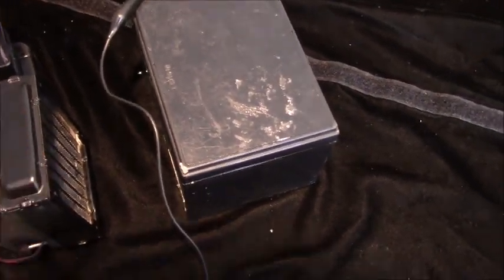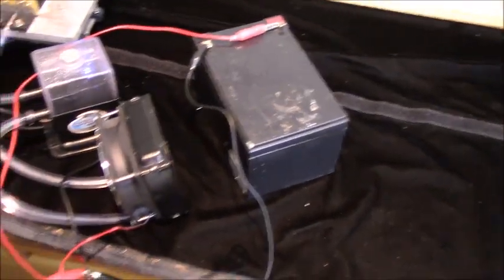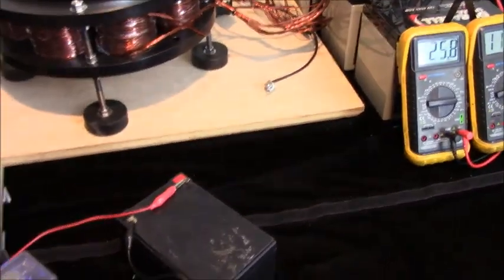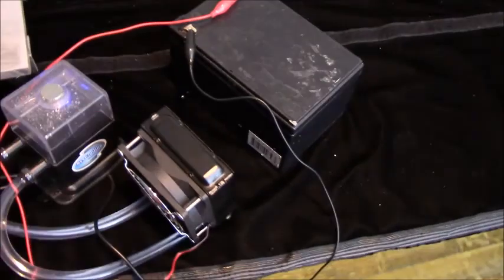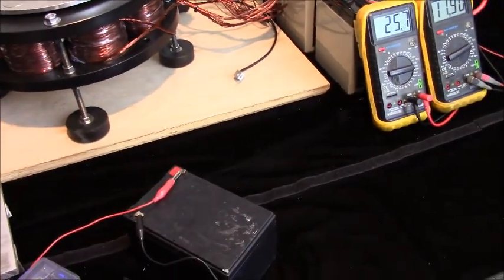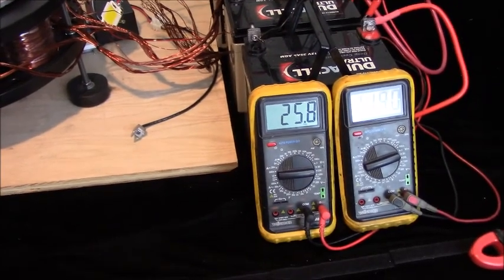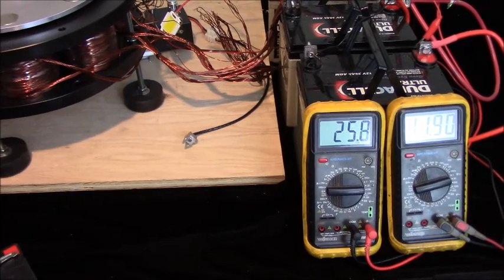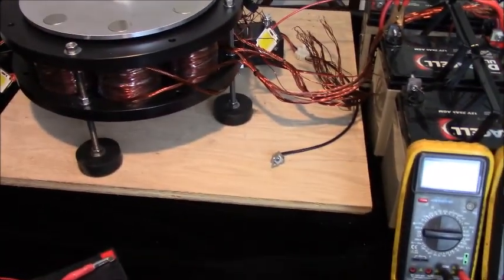Now I am starting to get the double fan, double radiator, double the size, I mean. I'm going to start getting those as an option as well, especially for the bigger motors. So this 4-pole with 4 MOSFETs on it should be fine with just this arrangement right here, because I could really run it off of just 2 with the water cooling, but that will tend to create a lot more heat than the 4 would, especially if someone's going to take it up to 48 volts and really crank this thing down. So that's it.